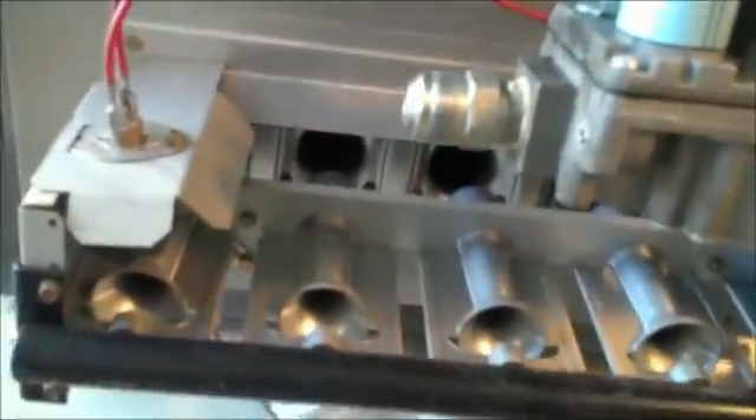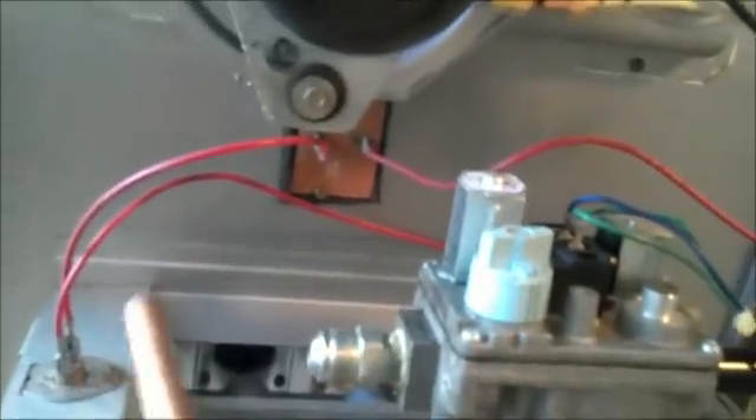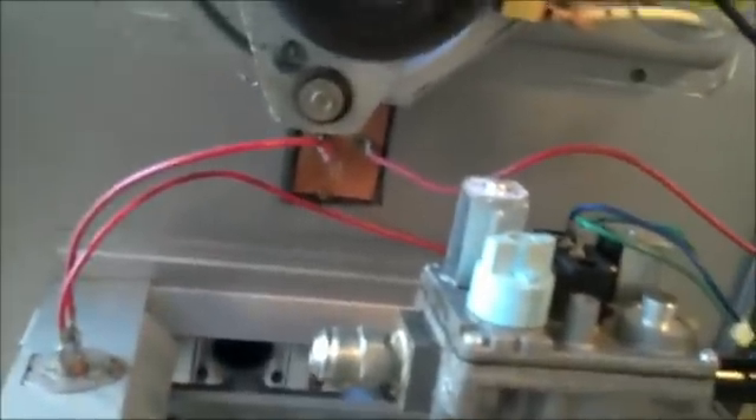You've got your rollout sensors here, plus a flame sensor right down in there — if it doesn't detect flame, it's going to shut off. If something's clogging a port and there's no flame in that port, it will shut down the whole furnace. You also have your high limit here. You never want to jumper your limits because they're there for a reason — to protect you and protect the dwelling from burning down.